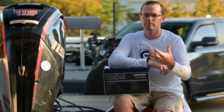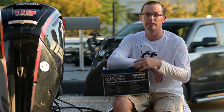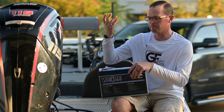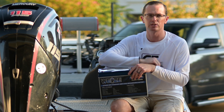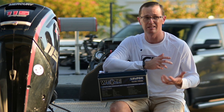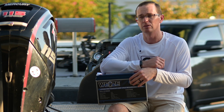So maybe I need a bigger inverter. The one orange battery did cut off like I thought it would, but this one didn't cut off on overcurrent. Maybe the overcurrent protection requires something like 130 amps to kick in. I was expecting it at 110 to 115 amps - that's already 15 more than 1C rating, so that's getting up there.